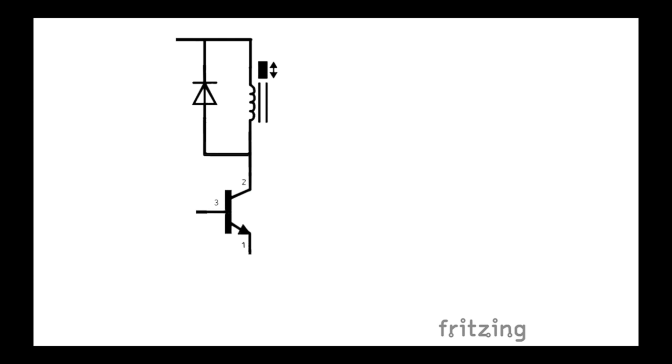What that would do is backfeed that transistor back into the collector, and it could potentially blow the transistor, because the voltage can be even in the thousands of volts initially for only a fraction of a second, but that could be enough time to blow a transistor depending on the transistor. Or if it doesn't blow it, it could weaken it to where it'll eventually give out. So we put this diode here across the solenoid, so that when the power is cut off, the only place for electricity to go is in this direction, and that will dissipate the electricity back through the coil instead of allowing it to come down here through the transistor. So that's all that's for.